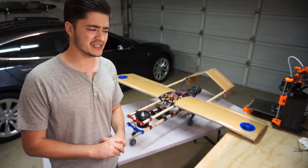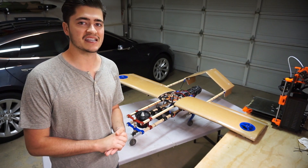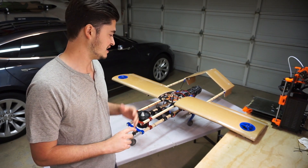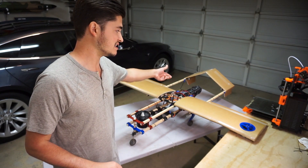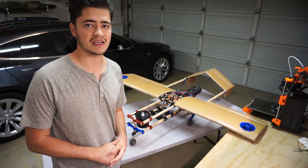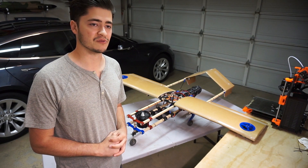The last couple of things I'm looking at — you may have noticed from these flights — there's a pitch up happening on the inbound transition pretty consistently. I think it has to do with the rate that the lift motor up front spools up in relation to the rate that the nozzle in the back is slowing. I'm going to take a look at that; I've got plenty of video and plenty of log data. But otherwise, I'm really happy with the way it's flying.